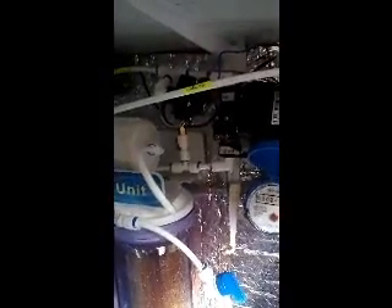Just up in the corner behind the meter is my booster pump, and there's a pressure gauge showing the pump pressure is about 100 PSI. This little black thing here is a low pressure switch — when the stopcock turns off the water supply, the low pressure switch stops the pump running, otherwise it would burn out without water coming through.